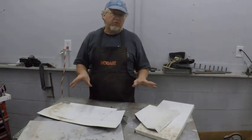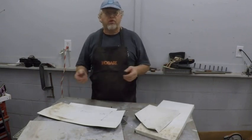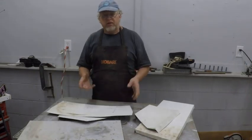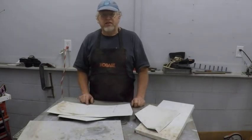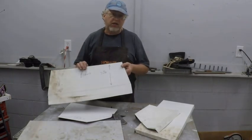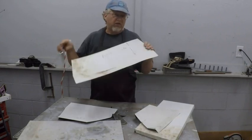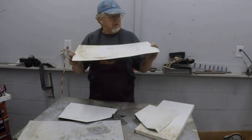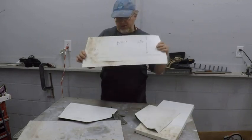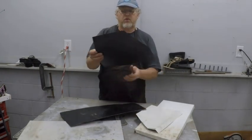Like I say, anytime you do a project like that, take the hour it takes to take cardboard or really thin plywood or, like me, sheet metal, and build it out of it. It doesn't take that much extra effort to do it, and that way once you get it done, you got perfect templates to make everything, and you've already gone through it one time in your head. And I mean, this was like the third attempt at the design I wanted to use, and after three attempts, I finally got my angles the way I want it.